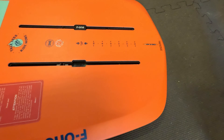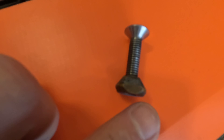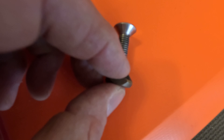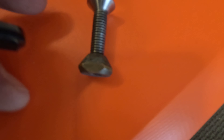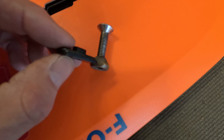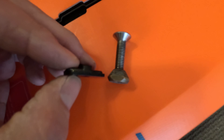Got to use the M6 bolts it seems like. The other thing too is the distance — the actual flange part of the t-nut is thick, and it's too thick. Here's the one on this track — this is how skinny they have to be to fit in there — and this one right here is way thicker. I did find a company that makes something more like this thickness and I did order them, but they're not here yet.